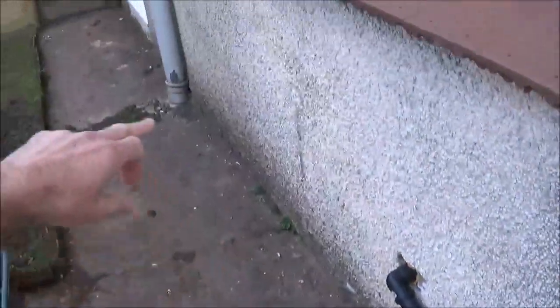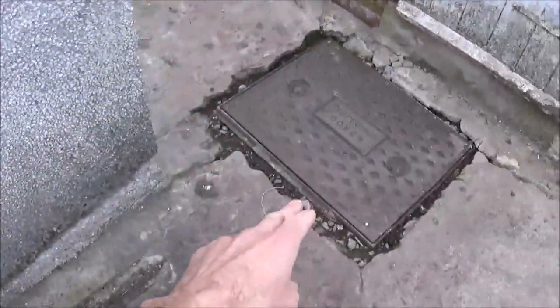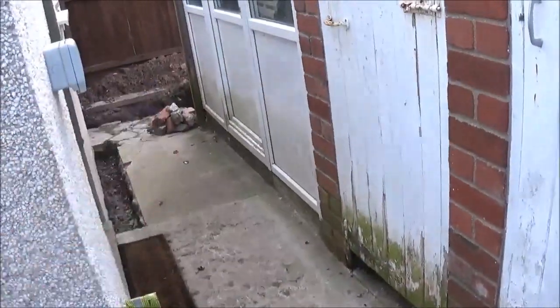In time, I intend to put a channel along this side of the house. I'll then run a French drain along here and into this drain, which connects into that foul sewer, which runs under the ground into the one I just showed you.